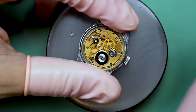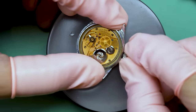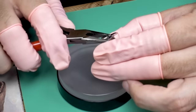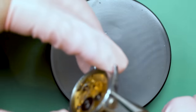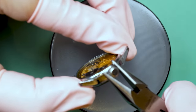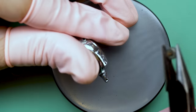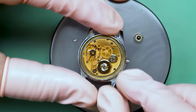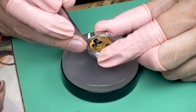So first I'm going to try to remove the crown — you need to undo that screw to take it out. But as you can see, it just will not budge. It won't move at all. I can't turn it or pull it out. So I'm going to get the heavy hitter out and see if I can break some rust loose. It's just not willing to give, but I have to take this out in order to get the movement out of the case. And it just broke off. I knew that was a possibility when I grabbed the pliers — that's why you don't use pliers on stuff like this.